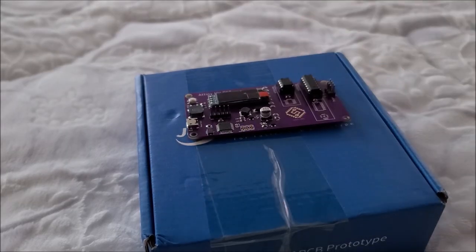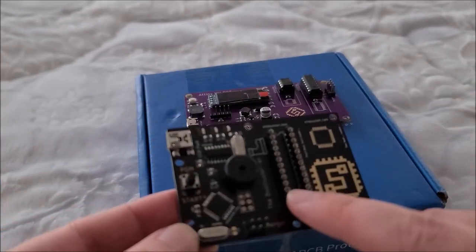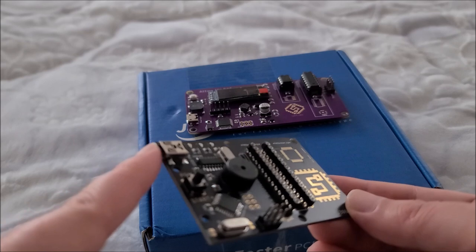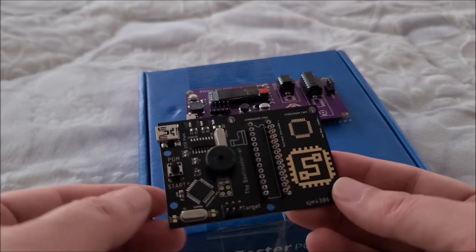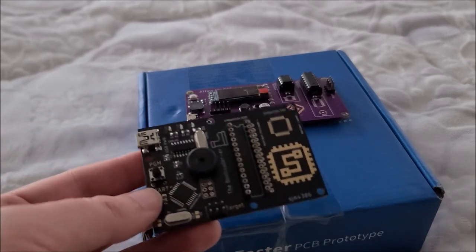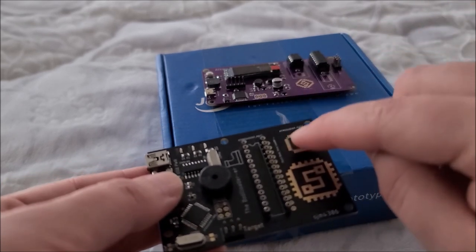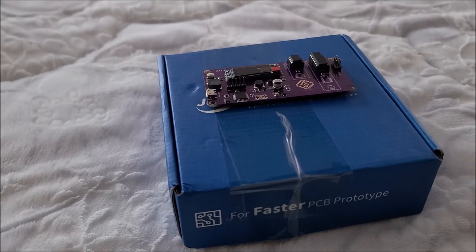This board is similar to two of my previous projects. I did a bootloader programmer — its only purpose was to program a bootloader onto an ATmega 328p, basically an Arduino Pro Mini or Uno, without needing a computer. It just needs USB power; you click the button and it auto-flashes the bootloader stored on another ATmega 328p. It programs its own kind. When it beeps, it's done; a long beep means error.